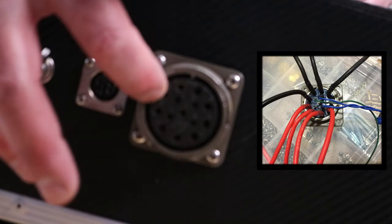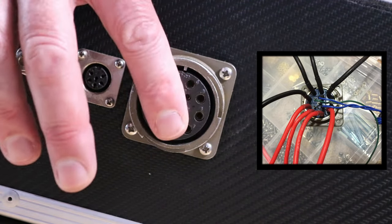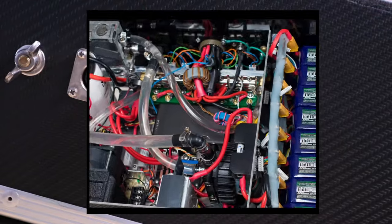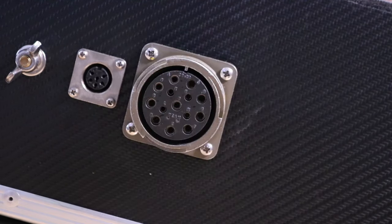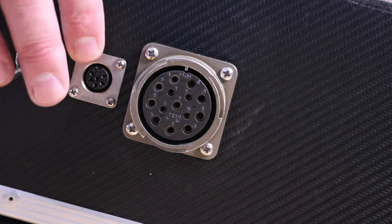The interrupter is here in the backpack—it's just taking control signals from the display on the gun. There are three connections to the gun. The eight separate bridge connectors are on the outer perimeter. The trigger switch comes into this connector and goes through a ferrite bead to keep noise out, then straight into the UD3. The DIN connector carries data and power for the display.